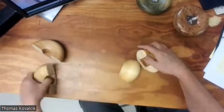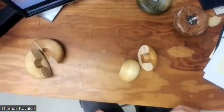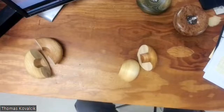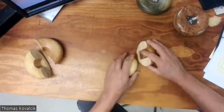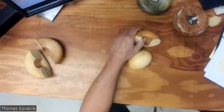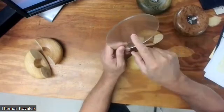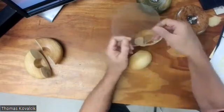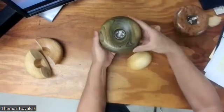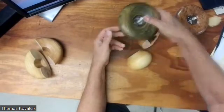And you asked how I use these, just to fit on a piece of wood. When I'm cutting up wood, it makes it easy to lay it out, and you can see all the defects in the wood with this clear thing here, and you can avoid the defects. You can also balance the grain because of the hole in the very center, so everything's even. If you look at this one, the grain is all even side to side, right? That's not by accident.